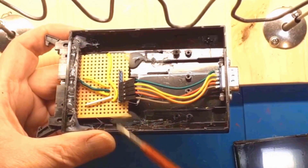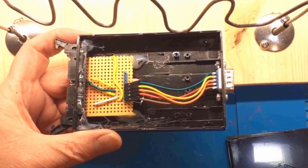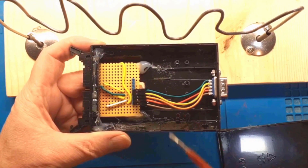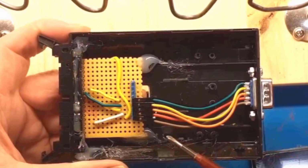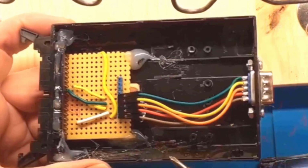On reflection afterwards, I could have used the smaller one. So there's a smaller one with 3 pins in. I could have used that, but so there's ground, 3.3 volts, and 3 connector cables for this terminal. This is a terminal, and this left one is a terminal, or tab. I'm going to call these tabs. Okay, so to make sure that they don't float, I've had to tie these up to 3 pins.